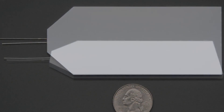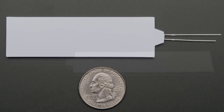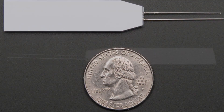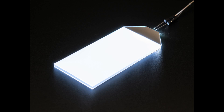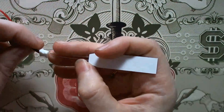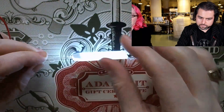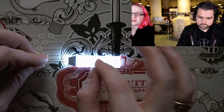So these are LED backlights — they're actually from LCDs, and you can buy them separately. They're really cool: a single white LED encased in acrylic with a special diffused acrylic that emits light from the front only. They have wrapping on the side and back so they don't emit from the bottom, which would make them half as efficient. You can put a gel on top, draw on them with marker, and it'll show up really nicely.